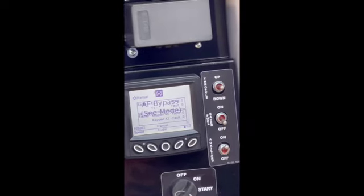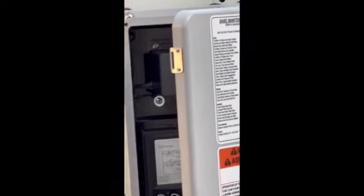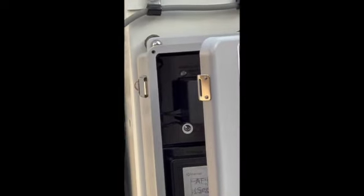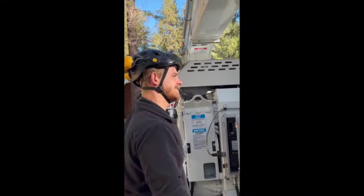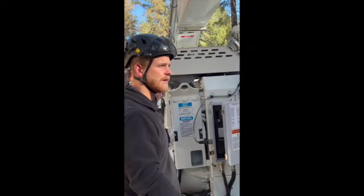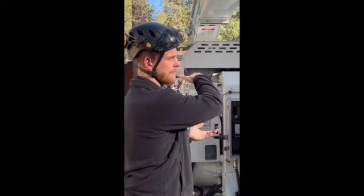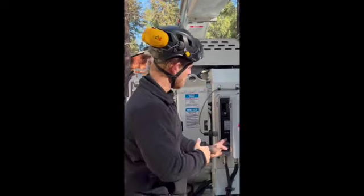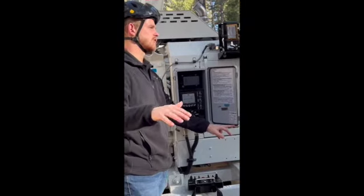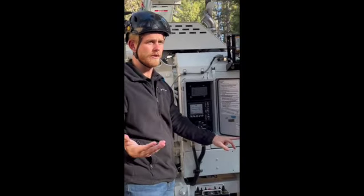So it's programmed to where this engine, let's say, is running at 2200 RPMs. Your feed wheels aren't going to start spinning until you get to full throttle at 2200 RPMs. When you put a 12-inch log through this machine, it drops it down, let's say, to 1800 RPMs. When it drops down to 1800 RPMs, it's going to back the wood out of the feed system, pick the engine back up, then continue to feed itself. When we bypass that system, you just turn that off. So essentially the machine's going to feed itself till it kills itself. You never want to chip like that.